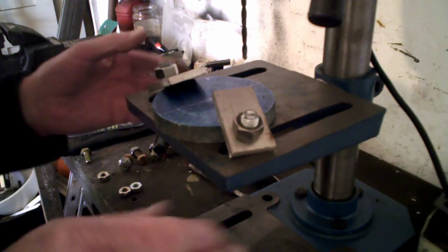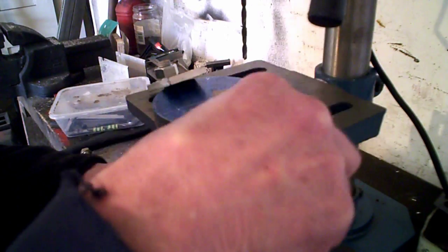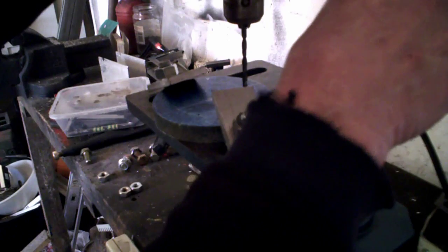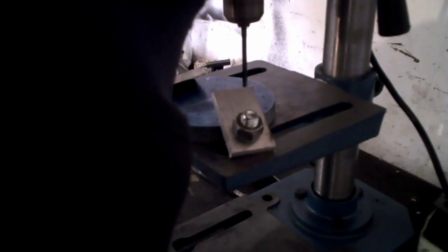There we are, we've got set up. Did I mention I made these 2 clamps? Ideally it should have an adjustable leg, you could have made a bit of bolt through or something, but these will do the job, and it's holding firm. And I'm over the hole in the middle. I'm doing a pilot hole first, and that is going smack on the line both ways, so we should be okay. I'm putting a pilot hole through first. Did I mention that? Can't remember.